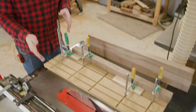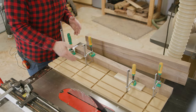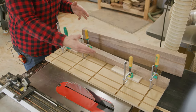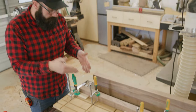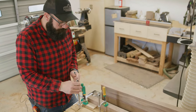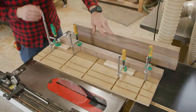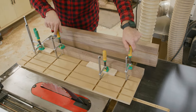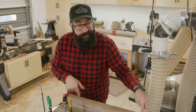Now I'm going to cut my tapers on my legs on the table saw using this jig I made. I've got a video on this jig if you want to see it, but it's very simple — it's just a piece of MDF with dovetail channels cut into it, and I use these dovetail clamps made by Microjig. I've set up stops on this that I'm holding in place with clamps, and these won't be taken off during the process. I'll undo these other clamps, flip the piece, so I can get my two tapers on two sides on each leg.